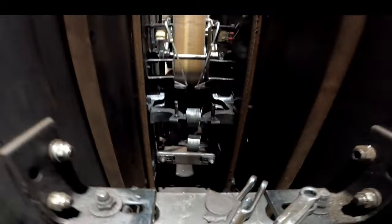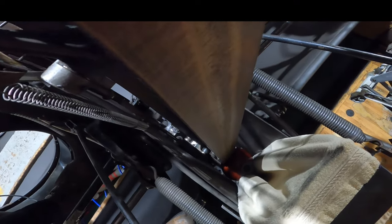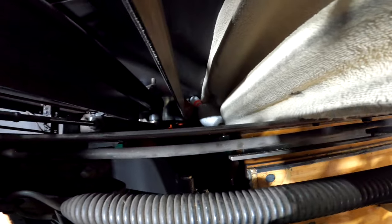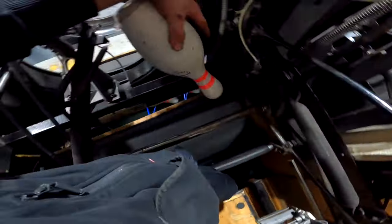With the solenoid shut, that will keep the ball out of the way. Looking deeper in, there is a ball wedged in the lift between the pin and the lift rods. To dislodge the pin, if a bowling ball is stuck behind it, use your hand to move the belt backwards to relieve pressure that the bowling ball is putting against the pin and the belt. Positioning yourself in the pit area of the lane where the ball jam occurred gives perfect access to the pin wedged between the lifter rods and the ball. From there it is easy to reach the pin and lift it up and out, then throw the pin in the pit.